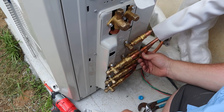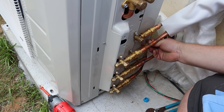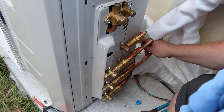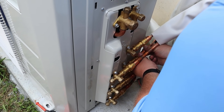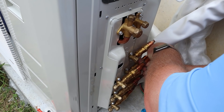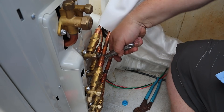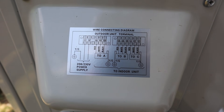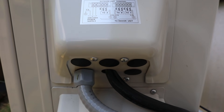While I'm literally sitting on the ground hooking everything up, I want to explain a couple of things. The condenser unit — the box that sits outside your house with the fan on it, sometimes called the compressor — looks more complicated than it really is. Depending on whether you have a single, dual, triple, or quadruple zone, you're going to have that number of brass fittings to connect. If you have a three-zone like us, you'll have six. The biggest thing you want to do is mentally label each of your air handlers inside with a letter — A, B, C, or D — and connect the hoses and electrical wires to the matching label on the box so the unit can properly control refrigerant and electricity to each zone. The connections are easy: use an adjustable wrench or channel locks, tighten everything down, fit the wires in, and everything's labeled. It's really, really easy to do, which is why they mark it as a DIY product.